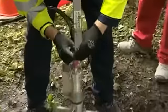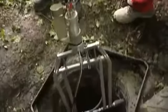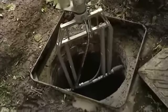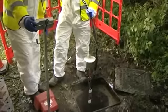This is the TSSR cleaning head. It's adjustable from 50 centimetres to 1.2 metres, but with extension bars, it can be used in shafts up to 3 metres wide. With the pump switched on, the nozzles swing into action, discharging water at up to 385 bar. At this kind of pressure, it's highly effective in scouring the concrete surface and blasting away any loose material.